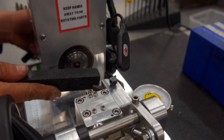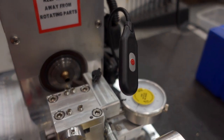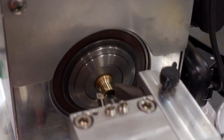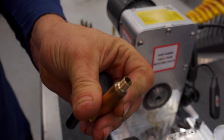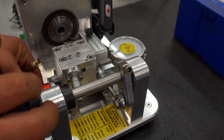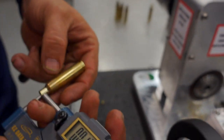What we'll do, make sure our spindle is clean, no chips. And when you're setting it up, you'll see, well, maybe I'm cutting a lot off the inside, maybe I'm cutting a lot off the outside. So here you can see we're full clean up on the outside. We still have a little bit on the inside. So what we'll do is we'll move this cutter. We'll move that whole cutting system in 1 thousandths. And you can see we're at 12.5.